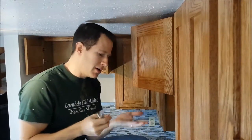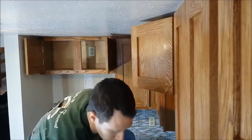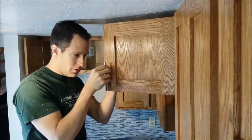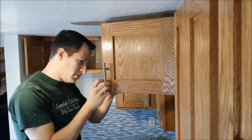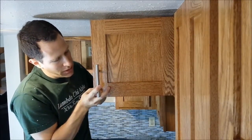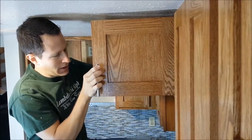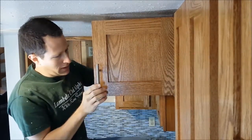Pretty much all hardware comes with four screws, although you obviously only need two. You've got two long screws and two short screws — almost all the time you're going to use the short screws. You can see they just pop out just enough to give a nice hold. You really want it to go in nice and smoothly; you don't need to over-tighten these. If you're having to use a lot of muscle and it's not lined up right, you probably need to check your holes and make sure you drilled them in the proper location — if you didn't, this is just not going to turn out right.